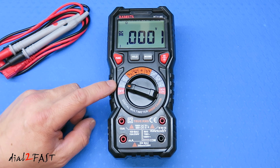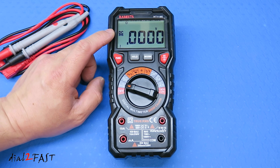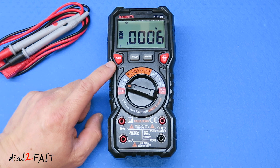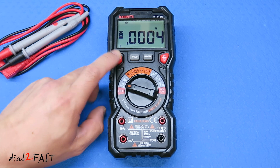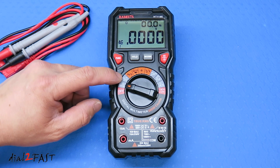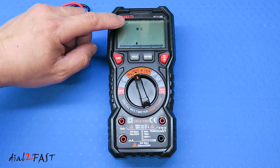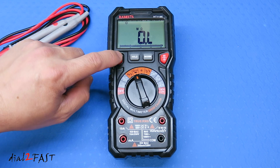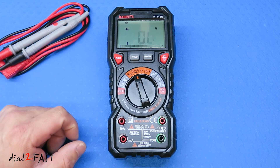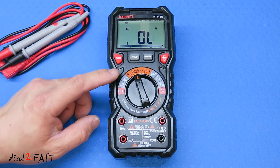This multimeter can measure both AC and DC voltage. The LCD currently says DC voltage. If you want to measure AC voltage, press the function button to toggle over to the AC voltage measurement. With each test function there are actually multiple modes. For example, if I switch over to resistance, it measures resistance. If I press the function button again, it measures continuity, and once more, it measures diode. That's how you toggle between each different test function.